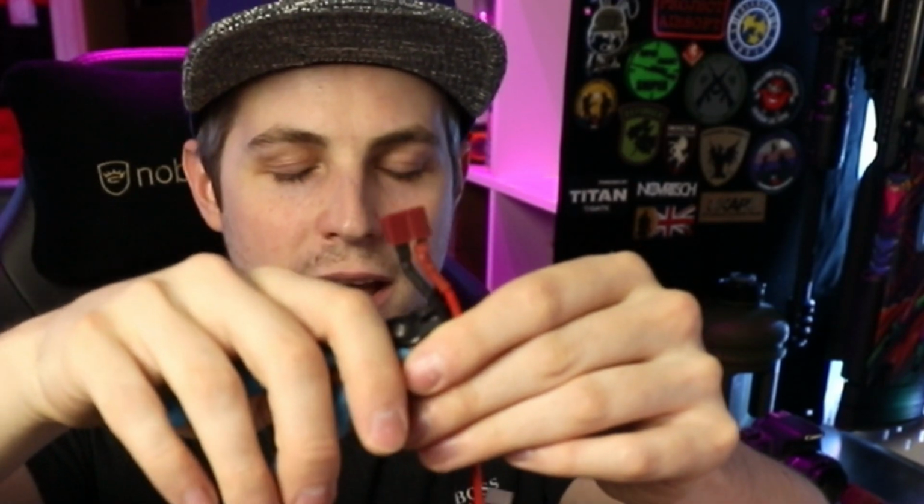And I learned this the hard way once when I did something really stupid. I had a battery just like this, which I was going to be swapping the connectors off of. So I came in wanting to save time, because I'd just done a riff as well. And with a riff, you can cut both these wires at the same time like that. That's what I did with the battery. And because I wasn't thinking, when I cut through there, the tool made a short between the wires, and then it started sparking, and then the battery smoked, and then I had to throw the battery away because I just killed it. So just do your battery one wire at a time.